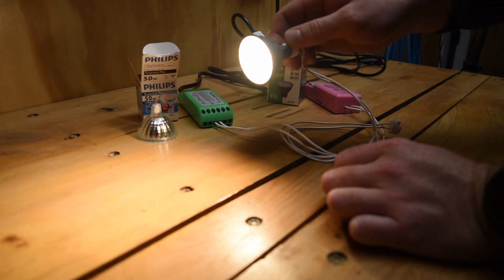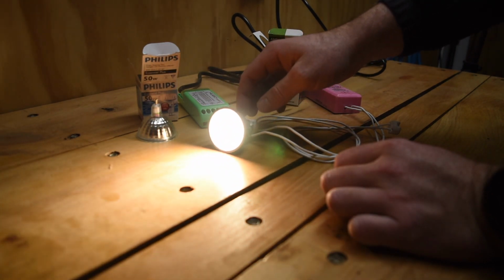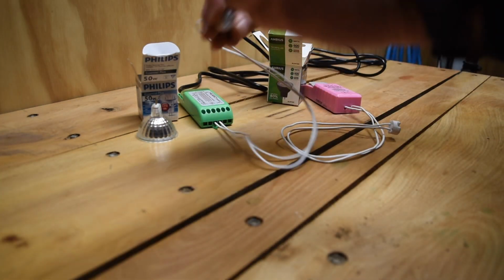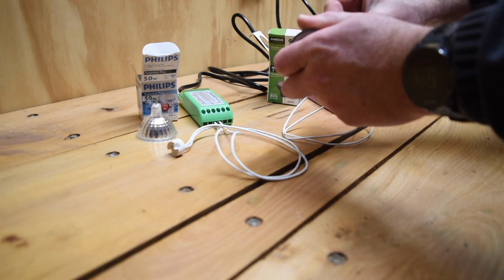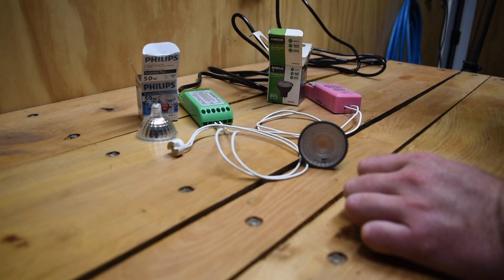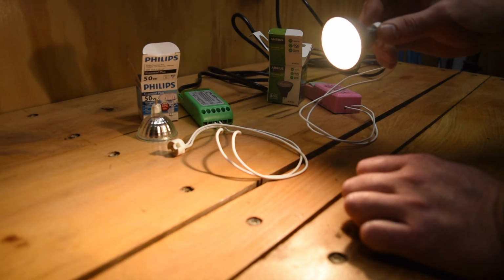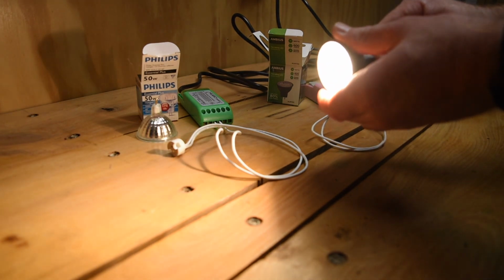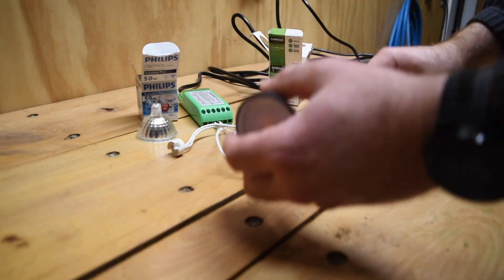but quite often after a bit of time you will notice a little bit of a pulsing. Kind of hard to see in this, but it's a common thing I see quite a lot as an electrician, so we quite often have to change the transformers out. Sometimes the other lamps, so just trying it in the new one, should expect to run fine, but sometimes the older transformers actually won't even run an LED lamp, they just won't go, and that's something that they don't tell you in the shops when you're buying one.